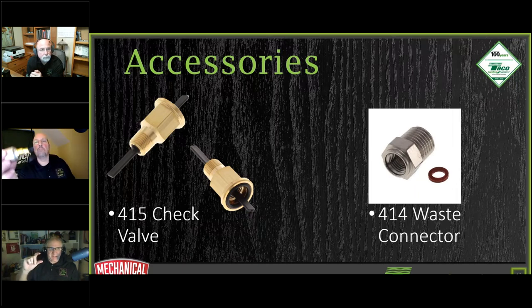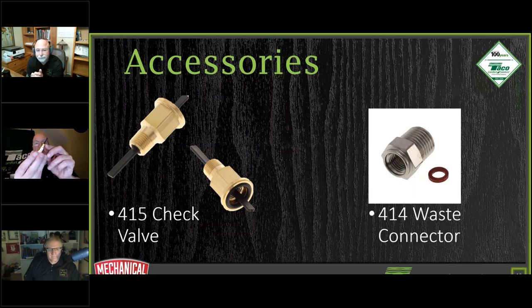It's an inch maybe. Well, the bubble breaker is going to be a little longer, but this is also plastic. So if you were in a short piece of pipe and in a through pipe there, you could probably cut that down if it was going to hit. Yes, this is longer than the bubble breaker itself. But the entire check valve, if you were close to a ceiling, when you install one of these things, you're going to add about an inch to your system. Okay, very good.